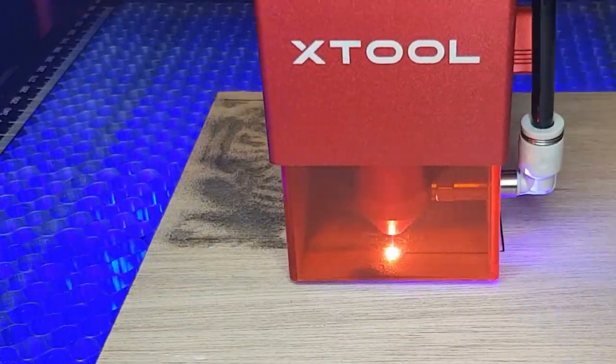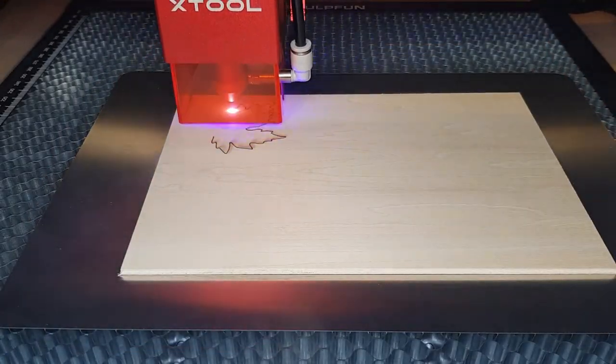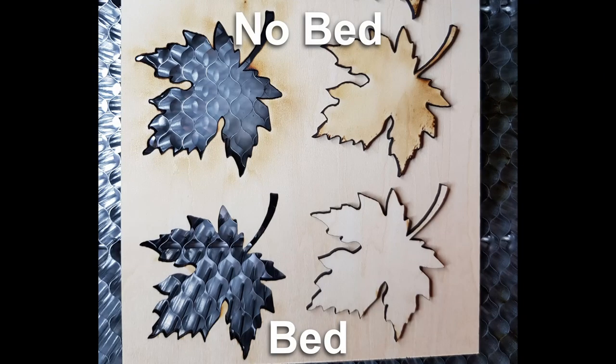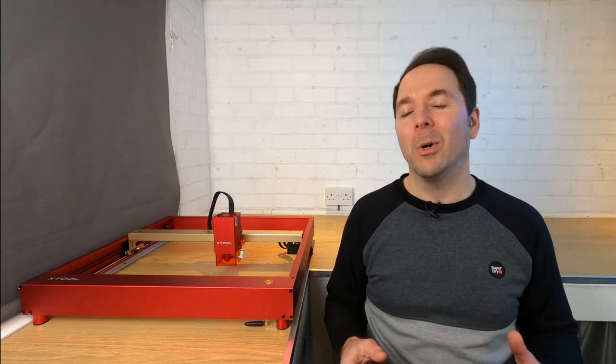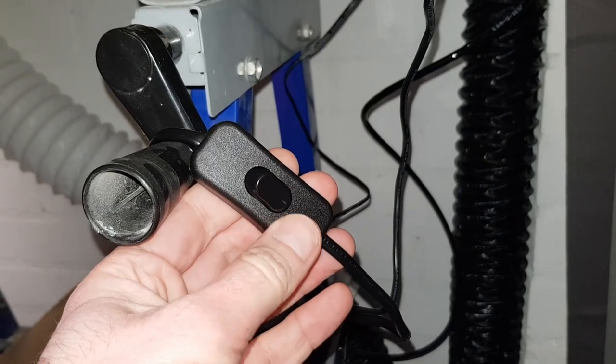The main reason why a lot of people will want to buy a desktop laser engraver is for cutting and engraving wood, and the D1 Pro is great at doing this as you'd expect. One accessory that Xtool didn't send me was a honeycomb bed — if you plan to cut through wood and want a clean backside then a honeycomb bed is a must in my opinion. It allows the burnt material to pass through and not stain the back of the job, and this works especially well if you have an air assist pump too. The D1 Pro is supplied ready to accept a feed tube from an air assist pump, and luckily they sent me one of these. Basically what an air assist pump does is blow air down onto the spot where the laser is focused to blow away any debris so it doesn't block the laser, and also keeps the work cleaner. I switched it on whenever I was engraving or cutting anything that removes a lot of material and it works really well.